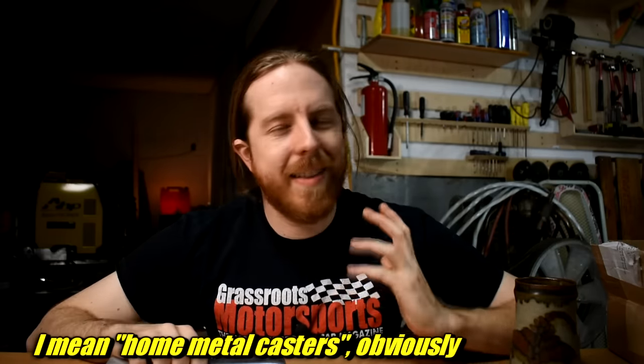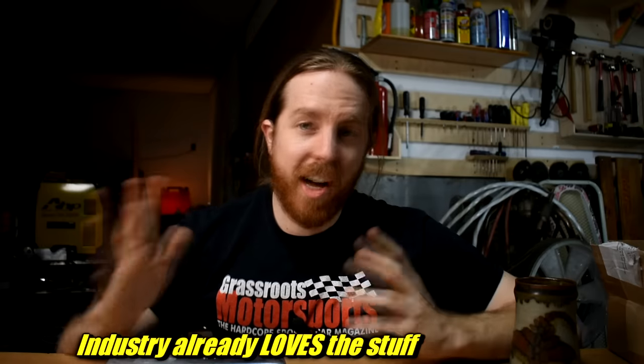It is a fantastic alloy. It melts colder than aluminum, a little higher than lead and tin. It flows into details really well. It's reasonably tough. It shines up really pretty, and it is cheap. So why don't more people use this stuff? Well, it's not lightweight like aluminum, but it's not as tough as steel or iron. You can shine it up nice and pretty, but it's still not as cool looking as brass or bronze. The low melting temperature is nice, but pewter is even lower temperature. So it's a great all-rounder, a great casting alloy, but not fantastic at any one thing. And then there's the zinc rot — zinc pest, it's sometimes called. We'll talk about that in a minute.